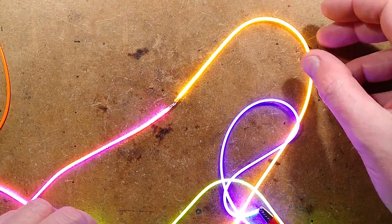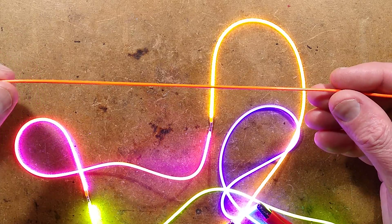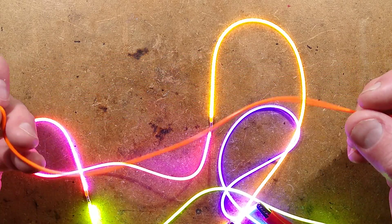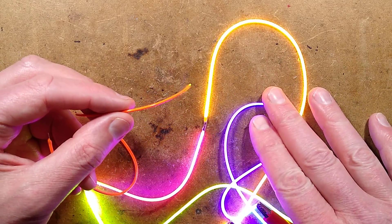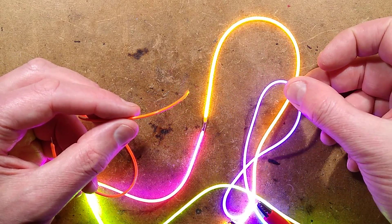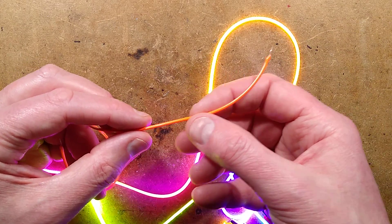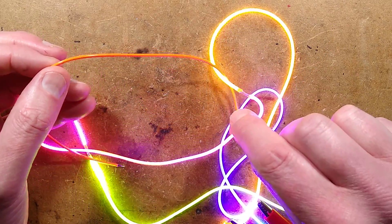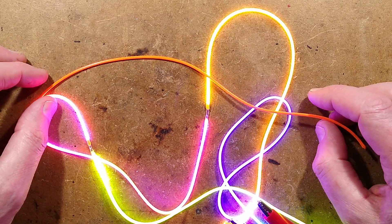The colours available are warm white, a golden white, green, blue, and a sort of pink. This red one isn't as bright as the other colours — nowhere near as bright. That's because red doesn't work well with too much blue, and blue is the main stimulating LED that excites the phosphor. They have to use quite a thick layer of phosphor to get the red while hiding the blue from sight — otherwise you'd end up with a pinky colour. So this one is a fairly dark red.